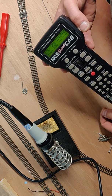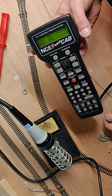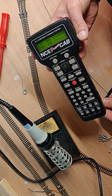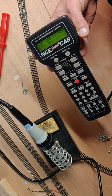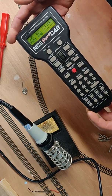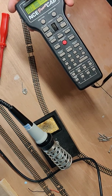So for the cost of £5.50, get yourself onto Coastal DCC's website and get one ordered if you're having the same problem. That's it for the first repair video — I hope it's been useful. You can see which part it is and where it goes in the handset, and it's really simple to get to. Just unscrew the back, take that one piece out, re-solder the new element in place, and away you go. Thanks very much.